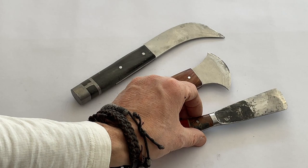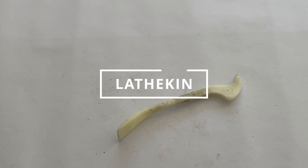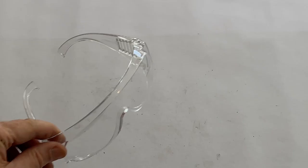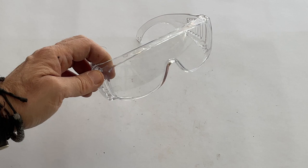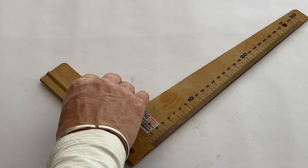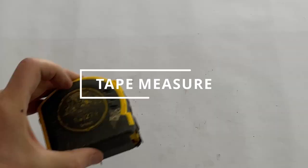This is called a lathekin — some studios call them fids — but generally speaking we use the term lathekin. It is used as a device for opening up the hearts of the lead, and I will show you how that's used in practice. Safety goggles are helpful as well, especially the larger format so you can actually wear glasses underneath them. You will also need a right-angled triangle because we set our window up to be square when we've re-led it. And a tape measure — everybody needs a tape measure.